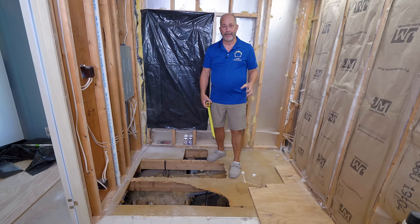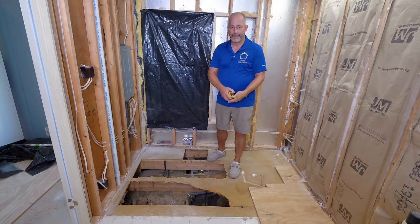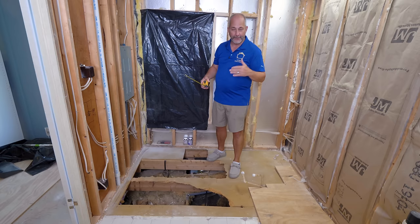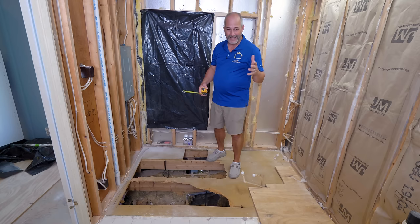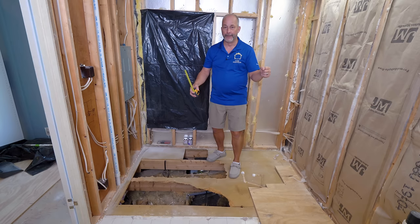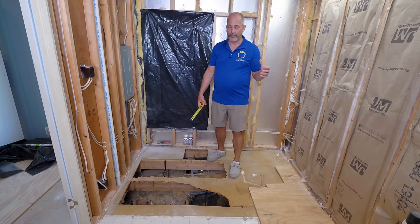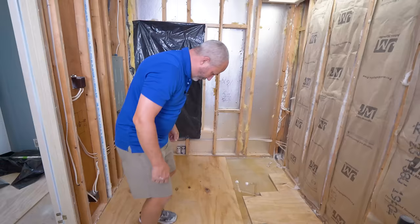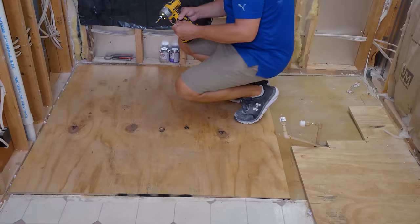We'll get the tub in a position we like, use our square to mark where the water supply has to come, then run the water supply. Full disclosure: I got the cheapest tub and cheapest tub filler I could find — from Home Depot — it came with a brass fitting but a really weak base. I've seen these perform poorly over time because people will grab it when slipping and rip it right out of the ground. You've got to think this through — make sure it's not in a place where you're going to lean on it to help get in and out.